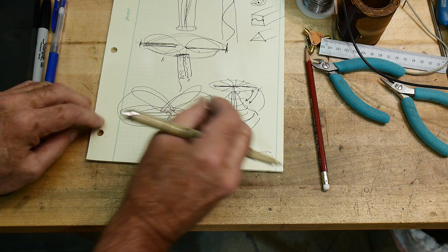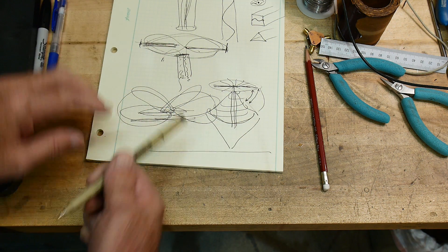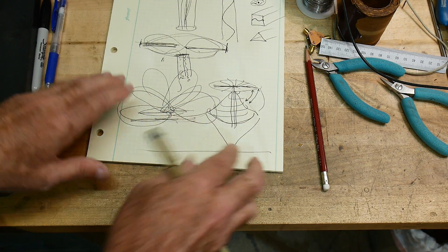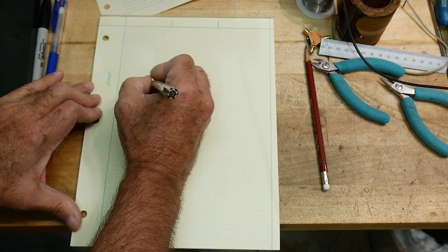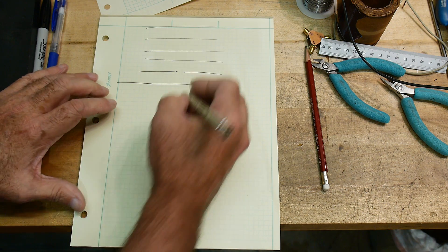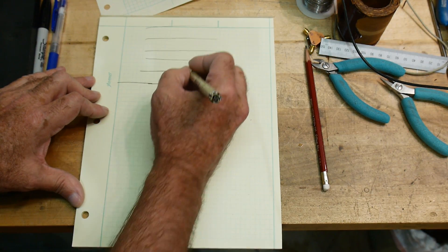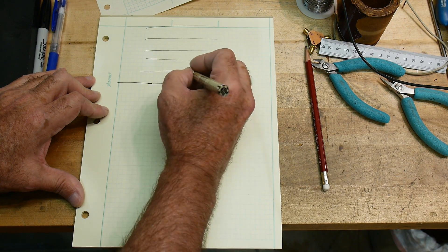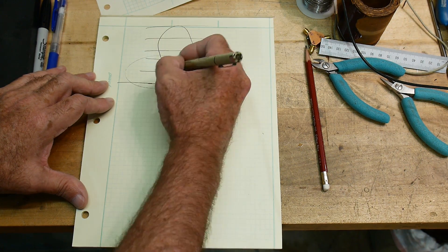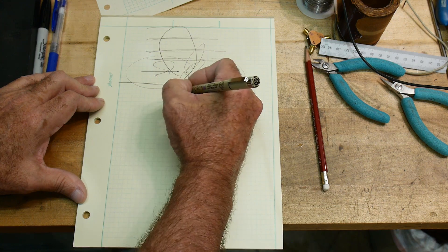We used to do that in LEDs — really, really tiny — where the dipoles are where electrons get changed into photons, and there's a mirror in that cavity. We used to solve Maxwell's equations in 3D to get those radiation patterns — the exact same equations as with antennas. You can also start adding directors. As the E&M wave forms, it reflects off the reflector but then sees these shorter directors and says, 'I can fit over there even better — I want to go this way.' Instead of getting broad patterns from the dipole, you get a very narrow beam with small side lobes. You're telling it, 'This is the yellow brick road, go this way.' That's a Yagi antenna — you can have a three-element or a thirteen-element Yagi.